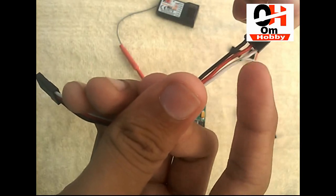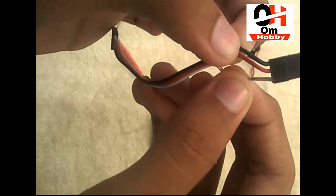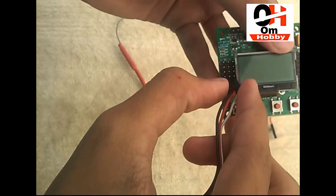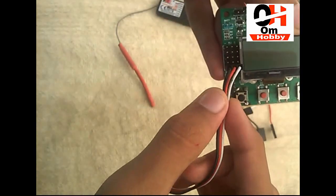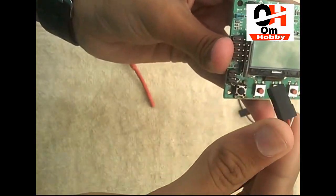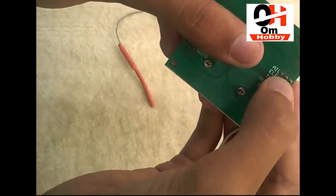For this kind of wires, if you look carefully there is a white wire, red, and black. The white wire means signal wire — the signal passes out from this wire. Those two — black and red — are the power wires. Always put your signal wire at the inner side of the flight controller board, meaning the white wire goes on the inner side.